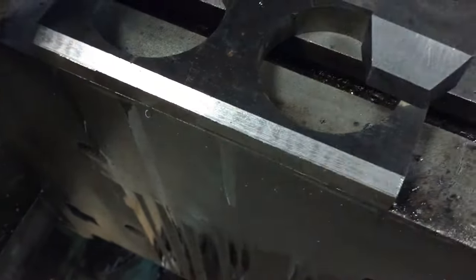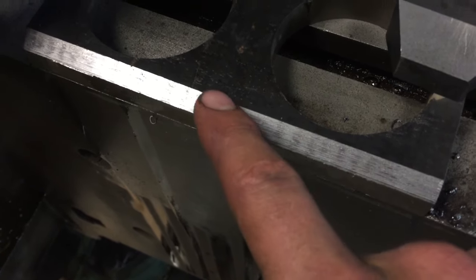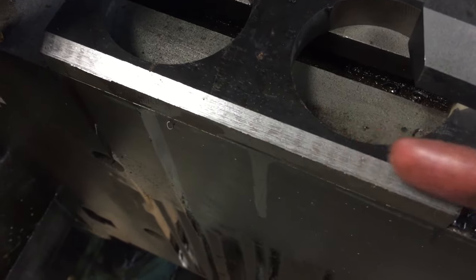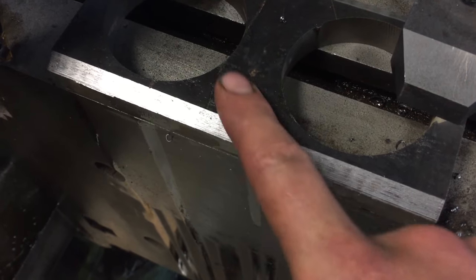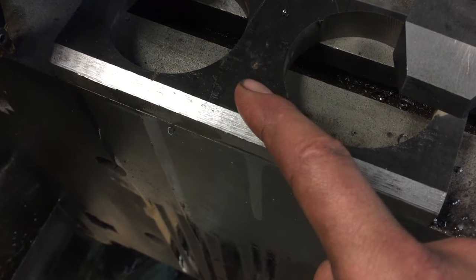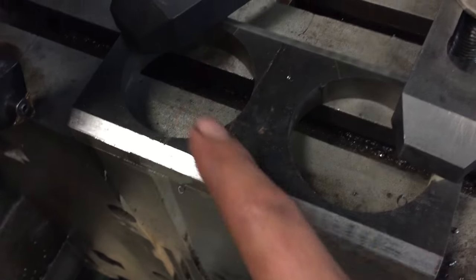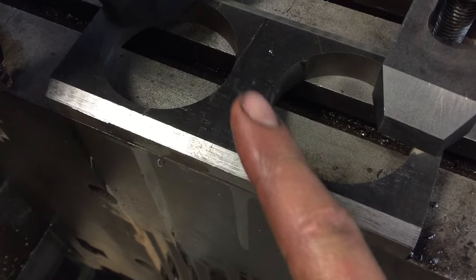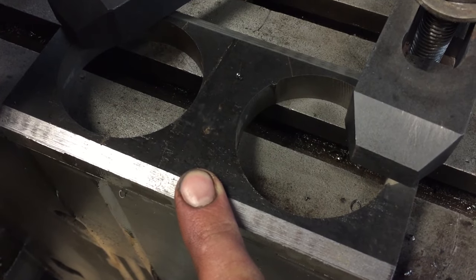The shaper's working really well, and the important point about using the shaper, or actually machining the weld prep, is this edge is perfect, and there's only 1 millimetre allowed for the edge of the vertical member, which is welded onto this, to sit on this face. And it's really important that it does sit on this face, not somewhere on this weld prep, because the design relies on that to ensure that the whole assembly is welded together accurately. This might involve a little bit of extra time, but it does save a lot of noise, a lot of dust, and grinding discs aren't cheap.